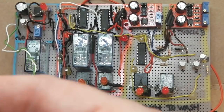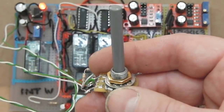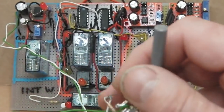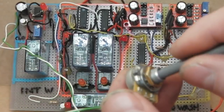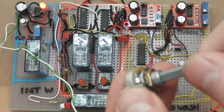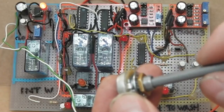And it's variable speed, so coming to your screen there, this will be mounted on the column of the steering and I can turn this. At the moment, it's actually the wrong potentiometer. We need a 1 meg pot. We're on a 220k pot. We don't get much of a range, but you'll see that's slowed down now.